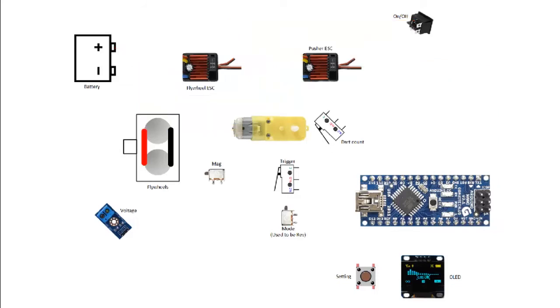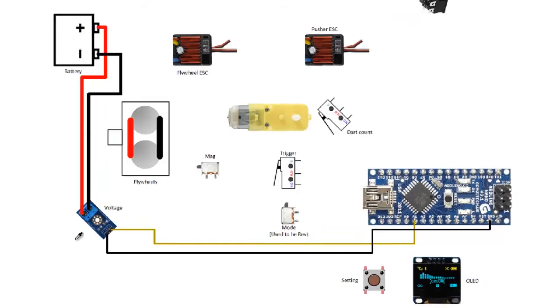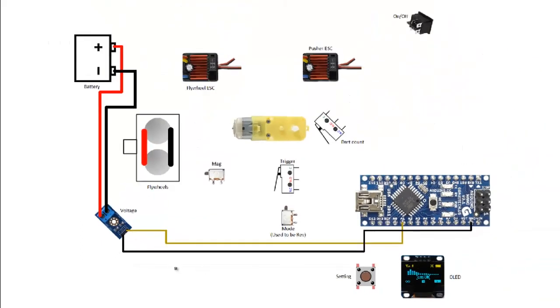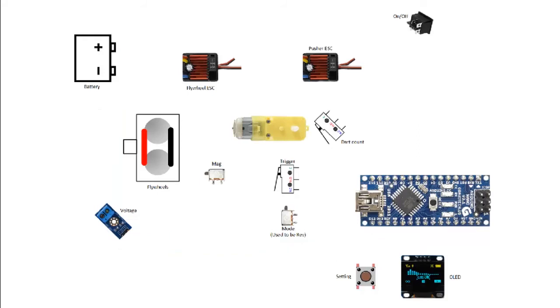The next one to consider is basically the voltage sensor. We will tap the power from the battery — we're just trying to get a reading from the battery. This goes into your voltage sensor, and then the voltage sensor needs to connect to the Arduino board. Looking at the voltage sensor, there are three connections that can go out, but we are not using the plus pin — we're only using the signal and the ground pin. So only two connections: signal to A1 of the Arduino and then to the ground.